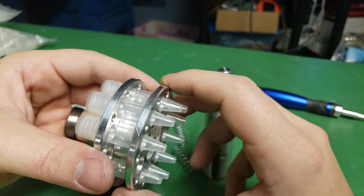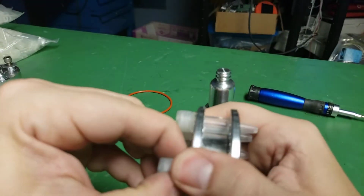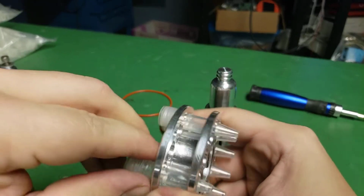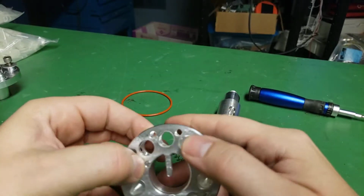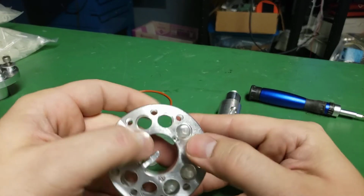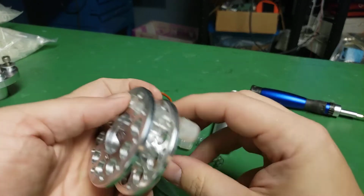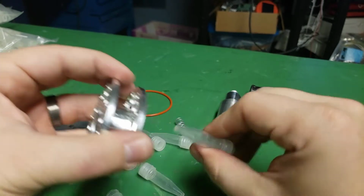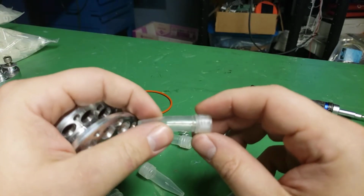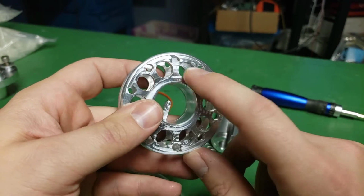There is this piece, which is actually 2 pieces. Ooh, that's another thing I want to tweak: I made these holes just a tad tight for the vials, which initially I was thinking would be a good thing, because then when the whole thing springs up, the vials kind of don't fly off. But it ended up being a little tighter than I'd like. So on the next batch, I'm going to make these holes just a tad bigger. I'll go one size up on the drill.